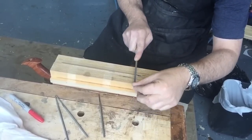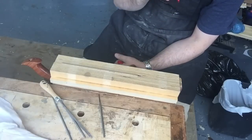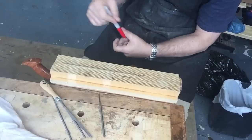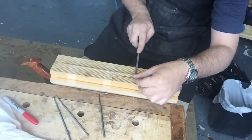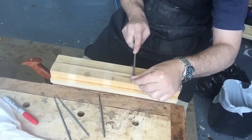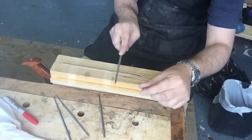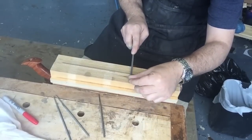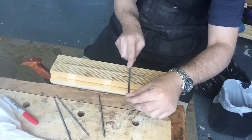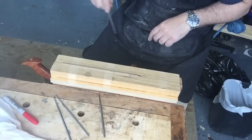So that's how I sharpen — I just go one, two, one, two. If I'm filing something that's not a rip cut, I might go with a marker just like this to give me some clarity when I'm filing. I'm going to continue and then stop the video, and then we'll see how it looks finished filing. It took about five minutes. Again, I've got the progressive cut — starting off gently and then more aggressive.